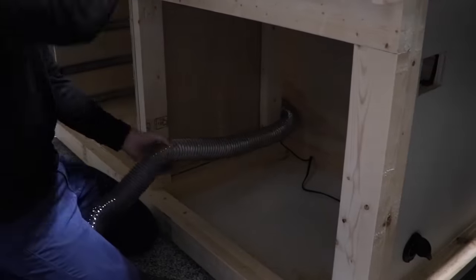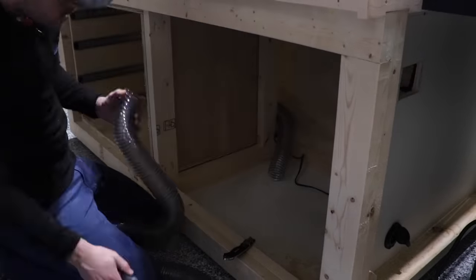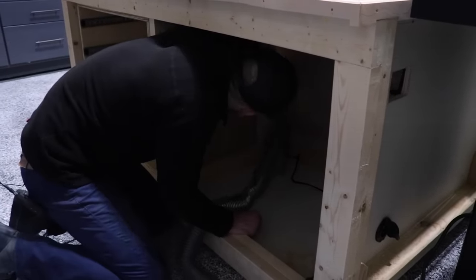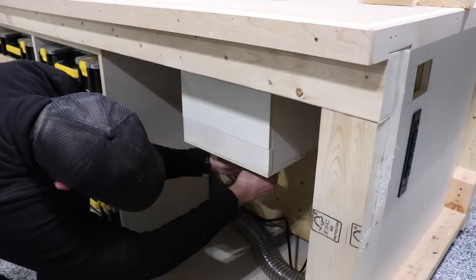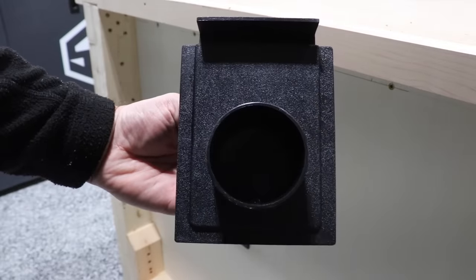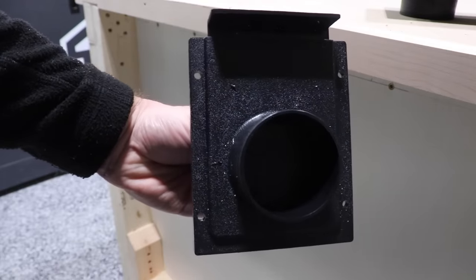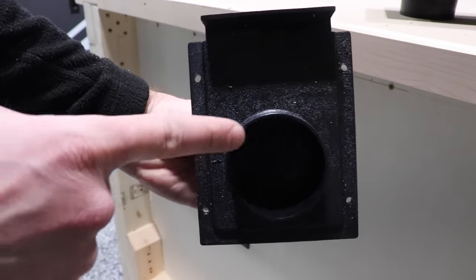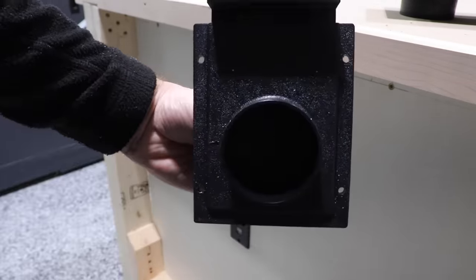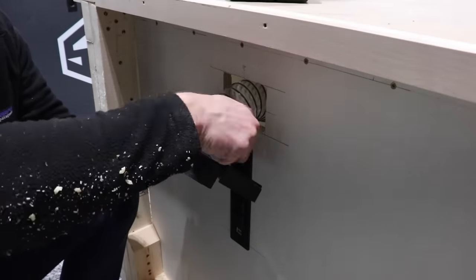Okay, so back to the mini dust collection system on the workbench. Using some 2.5-inch hose and a 3-machine fitting kit, which is linked in the description, the first thing I did was run the 2.5-inch hose lines. It's a tight fit in some spots, which is why you want to do this now rather than later. Next up is to simply add some mounting holes to the blast gates. Then just make all of the connections using the thumb screw clamps included in the 3-machine kit.